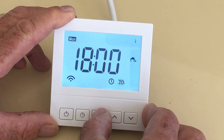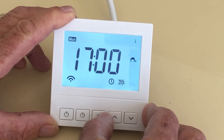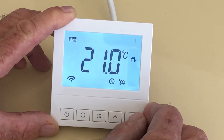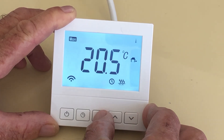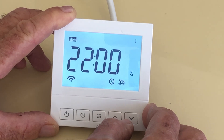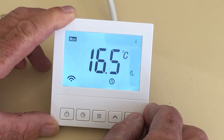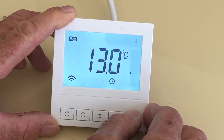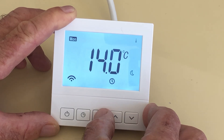At 5 o'clock in the evening, people like to have it a little bit warmer, so 20.5 or 21.5 looks quite good — just change the temperature using that button. At 10 o'clock at night, people are going to bed and this is the living area we're talking about, so you don't want it to be particularly warm when there's no one in there. Choose whatever temperature you want — it won't waste power but will keep the chill off the house.